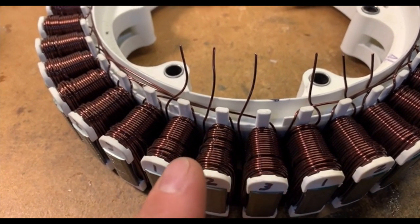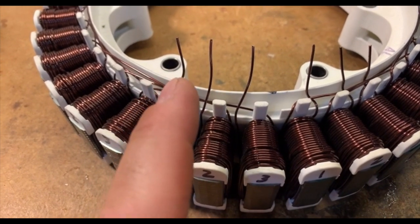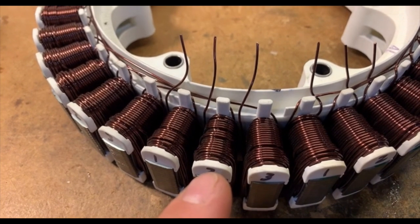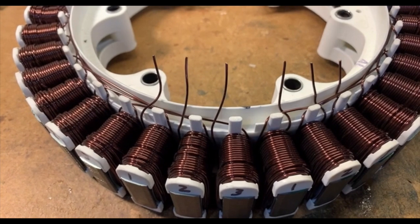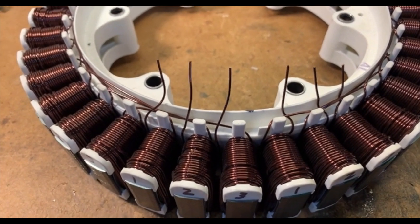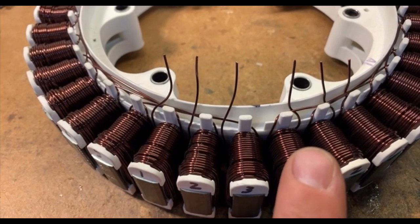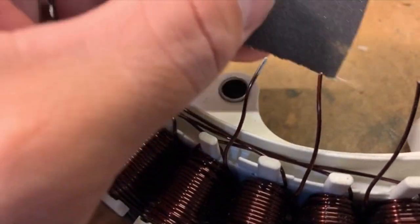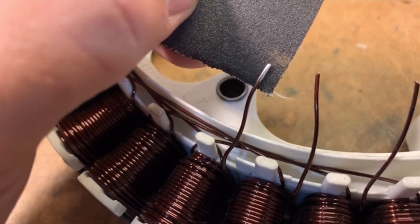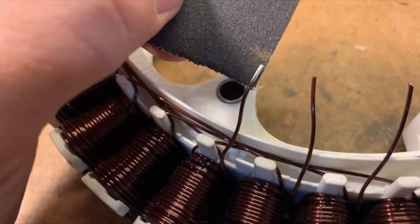You'll have to cut between certain coils — cut the wire between this one and that one, and again from here to there, splitting it. You'll have six wires total. You'll tie three of them together, and the other three are going to be the input for the second series of coils. To get solder to stick you're going to have to sand them lightly with some emery cloth, just like I did here. Do that to each one, then pre-tin them and add the wires.